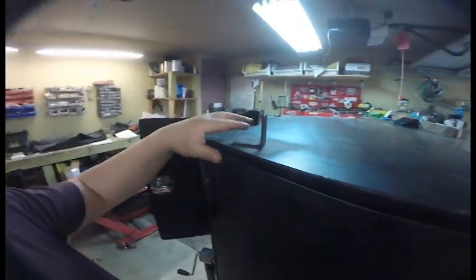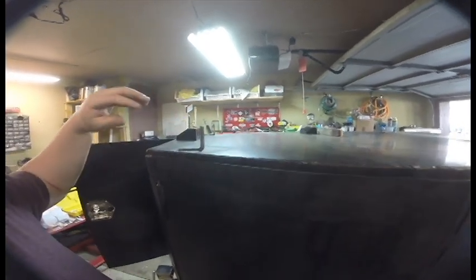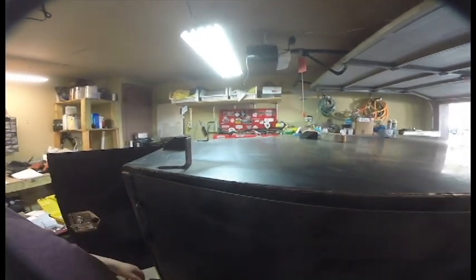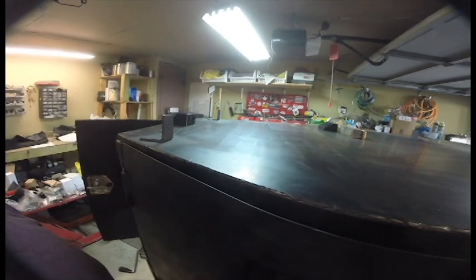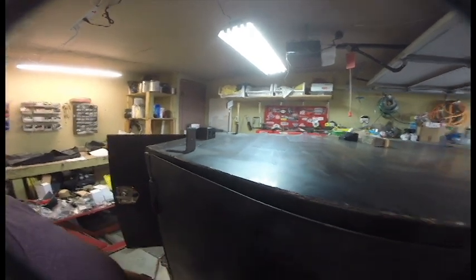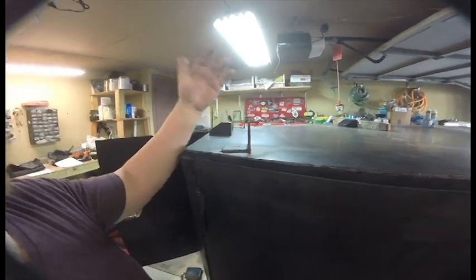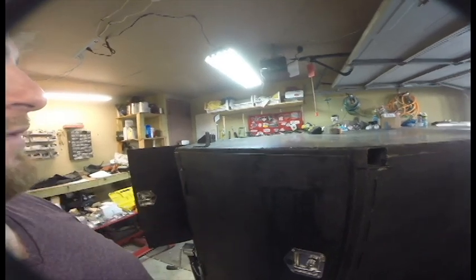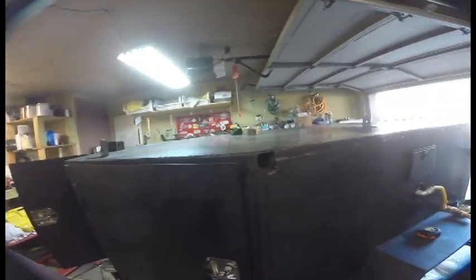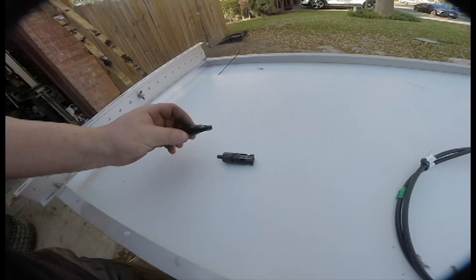The next step for installing our solar panel — I've built these mounts using two-and-a-half inch L-brackets, same stuff we used for the fridge. They mount to the screw holes for the Renogy mount so the panel can slide in and out left to right. I welded them to the roof — there's not a whole lot of parachute effect so it's pretty rigid on its own. If I want added security, I can remove one of the bolts and put a padlock on it.